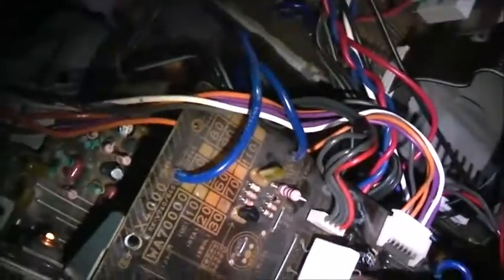The resistor there's a bit warm. It's been hot, but it doesn't get hot anymore because I changed its capacitor. This resistor no longer gets hot. Neither does this one because I changed the capacitor. Alright. This one is alright. So this is getting real hot, and these get warm, almost too hot to touch. So pull this out.